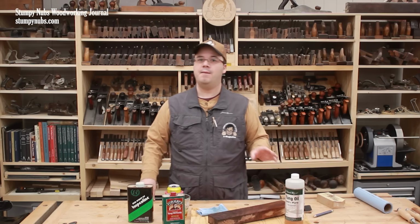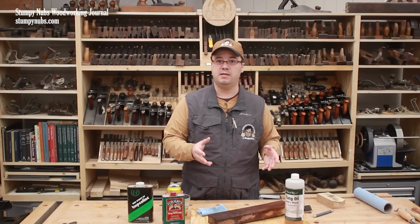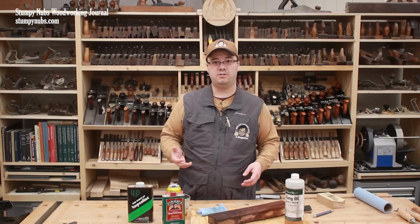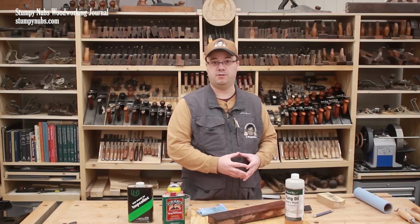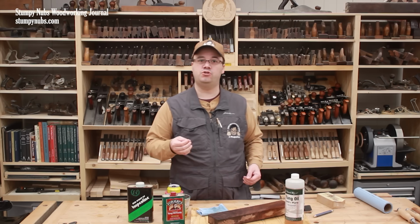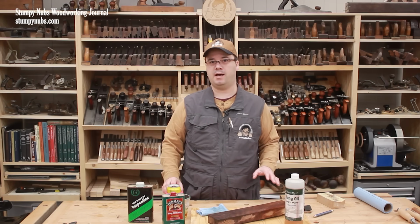Don't get me wrong. I'm not saying these blends aren't good finishes. Petroleum distillates are thinners. They make the finish easier to wipe on, help it to soak in better. Metal or chemical dryers or partial polymerization will help it dry faster. Resins can provide a higher luster if that's what you're looking for. They also may make the finish more durable, a better choice for projects that will see wear, such as tabletops.